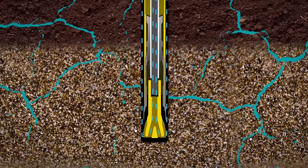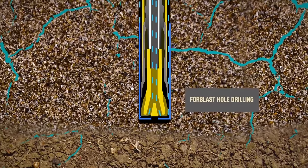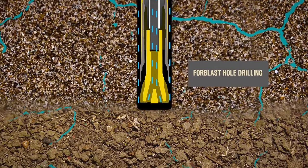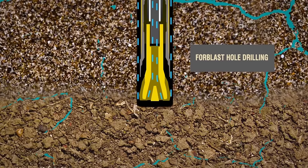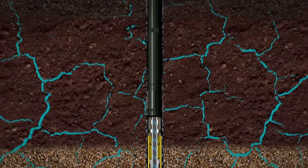For comparison, during the drilling method with direct blowing — which is mainly used for blast hole drilling — cuttings reach the earth surface using the same air pressure, but through the annulus, where the sample is naturally contaminated.